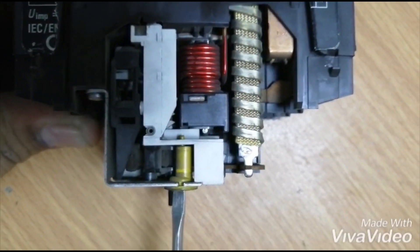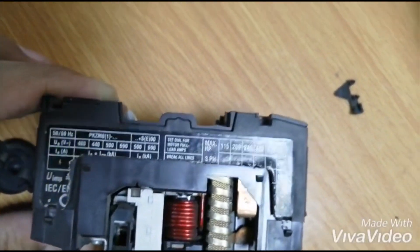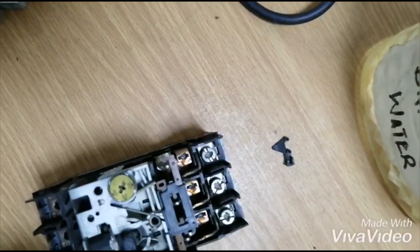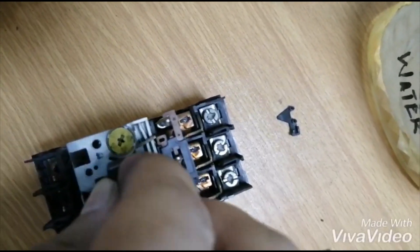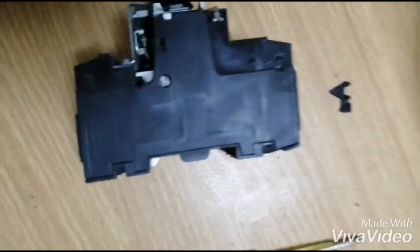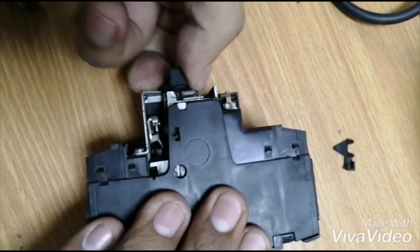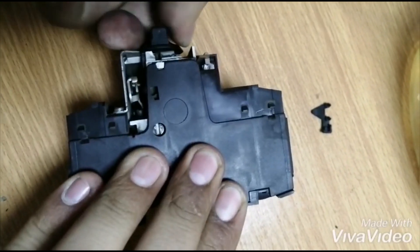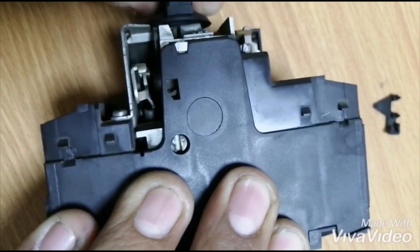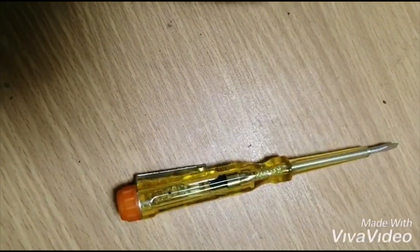The other part is short circuit protection. For short circuit protection we don't rely on the bi-metallic strip at all, because that would be too slow and could cause explosions with other devices connected to the circuit. Instead, we use an electromagnet — as soon as there is a short circuit, the electromagnet gets energized so quickly that it trips the circuit breaker instantaneously without causing any further damage.